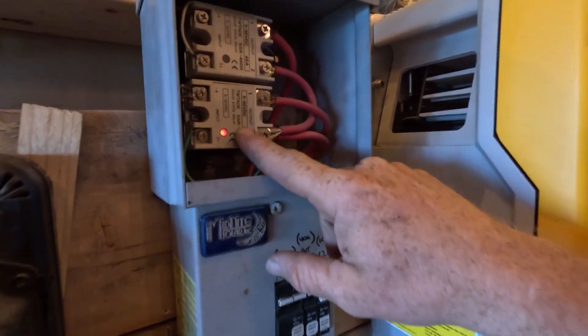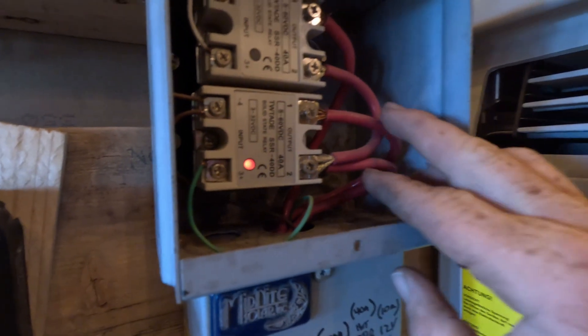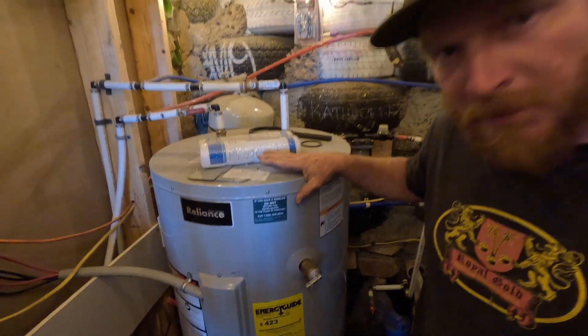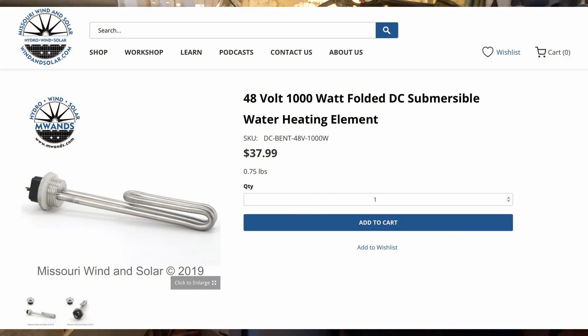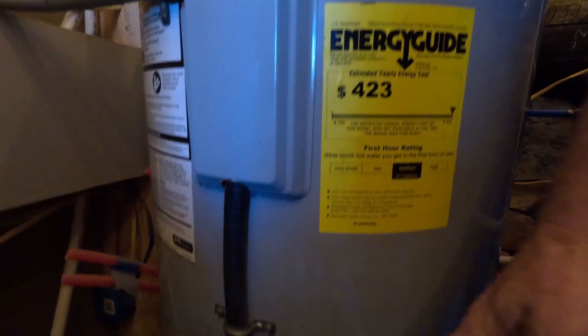It's a 40-amp relay. The small wires carry the 12-volt click signal, and then the bigger wires run to an element in a conventional hot water tank. Sorry about the mess — this is a messy mechanical room. I bought a 48-volt DC element from Missouri Wind and Solar.